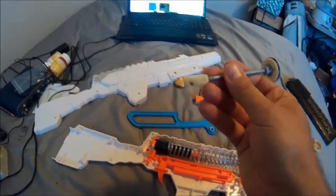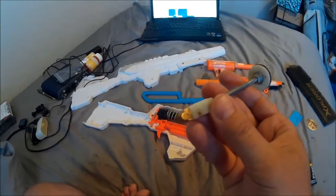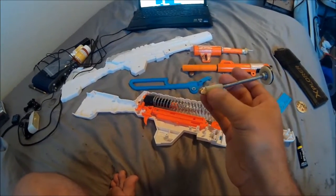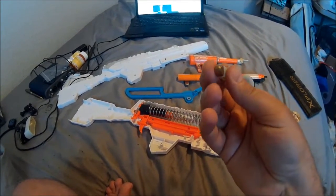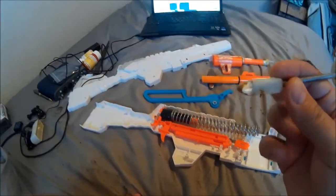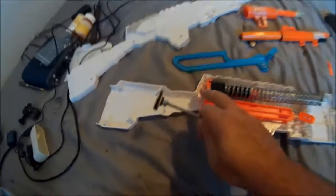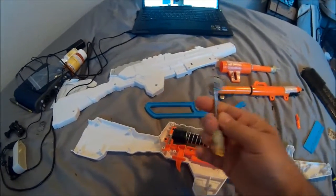But back here, this is a 1/2 inch by 0.19 inch nylon spacer. That has been super glued into this whole thing, into the threads. I actually worked super glue in the threads, put this in, and then I used a brass 10-24 back here, and I completely and totally dremeled all this. This used to be round. That used to be a round spacer. That nylon piece used to be a round spacer. And then I filed this to be like this, and then I filed this down so it rolls up on my catch, okay? And then this catch was all done by hand. So this is all done by hand, okay?